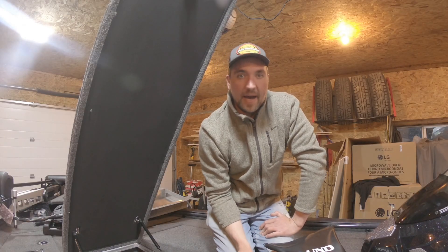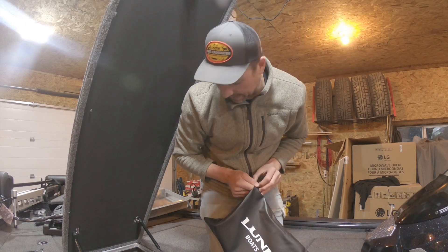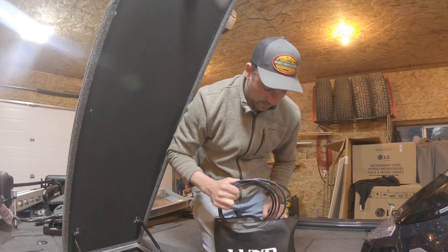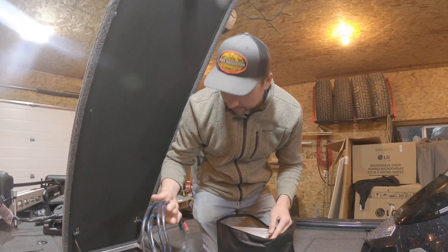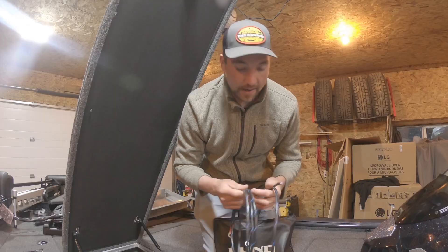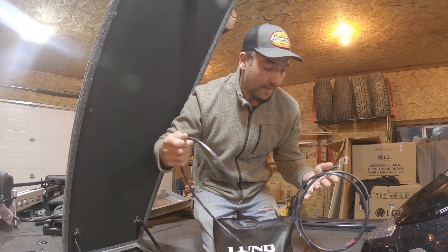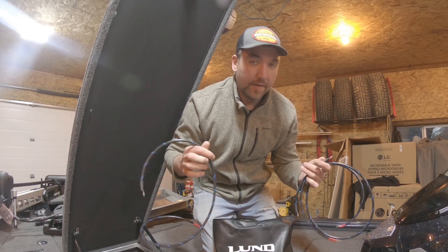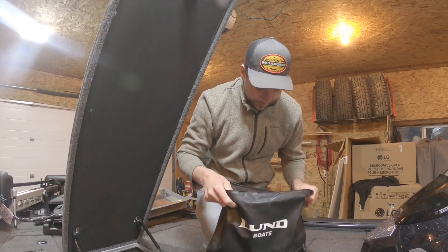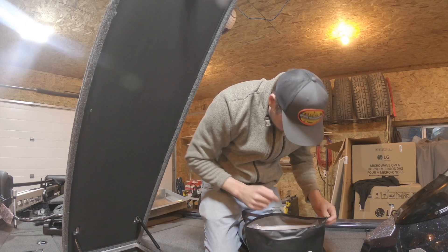Before we get deep into the batteries, I'm just going to get some jumper wires out first. This boat's already pre-rigged with a 36 volt system, so I'll need two jumper wires. Lund hooks you up with those. Not sure what other boat brands do, but if you're installing a 24 volt you need one, if you're installing a 36 volt you need two, and if you're installing a 12 volt you don't need any. Definitely check with your dealership before you start this process. In this case I have two, so that's good. Thank you, Lund.